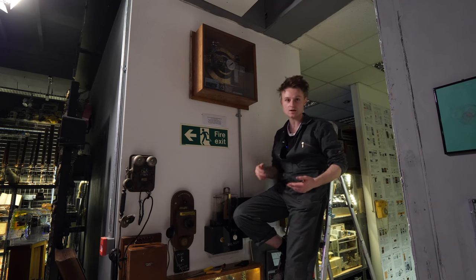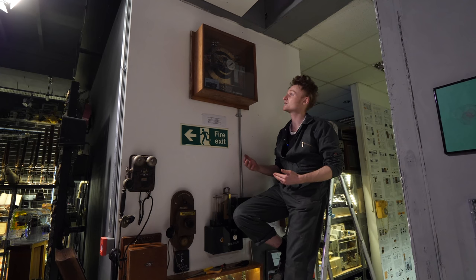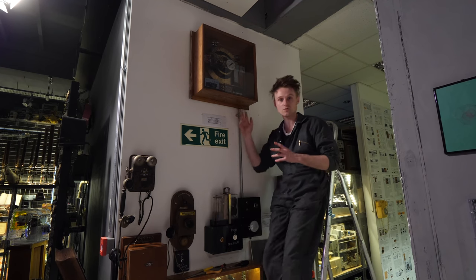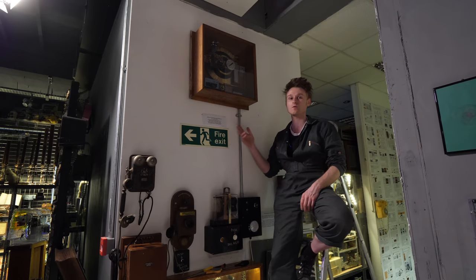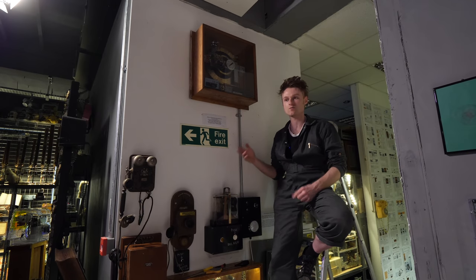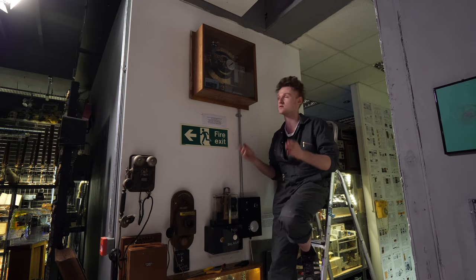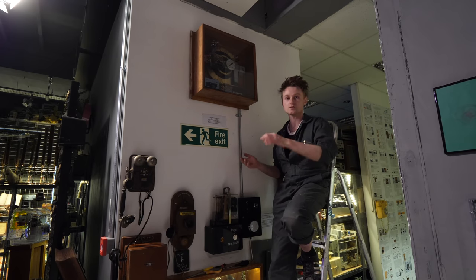The thing is, these are wired straight into the machine, and I'm just asking, what do you reckon? I can unscrew them, remove the mercury switches. That is doable without having to modify it in any permanent manner, because they are removable and the wires are screwed in, so you don't even need to unsolder them. And I can put a bridge over them.